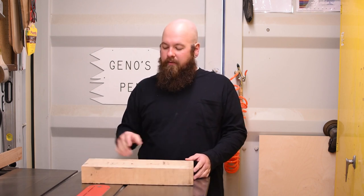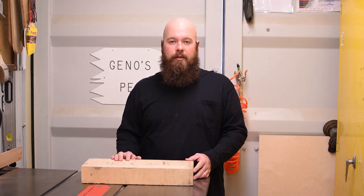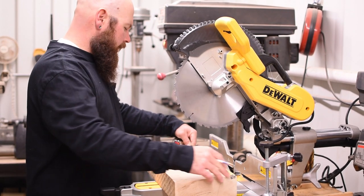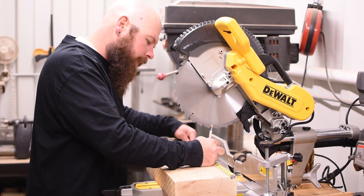I'm going to cut it directly in half so I can hopefully get six square blocks out of the wood for turning and making different projects. I'm going to use my sliding miter saw to cut this down right in half. It's 1 foot 6 and 3 eighths, so we'll mark it at 9 and 3 sixteenths — that should give us a pretty close center.